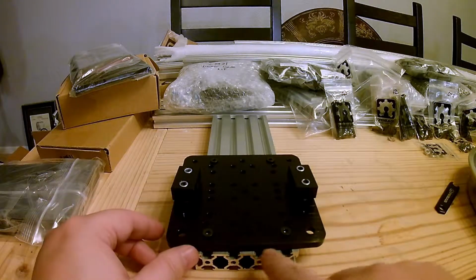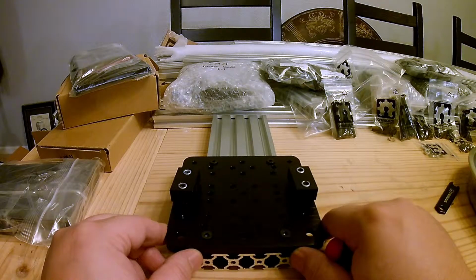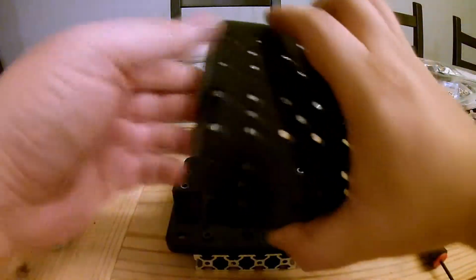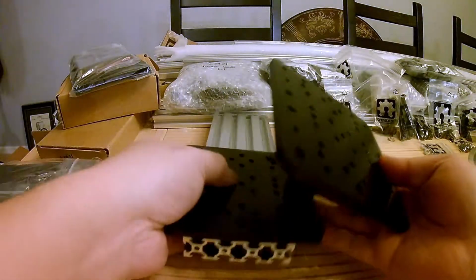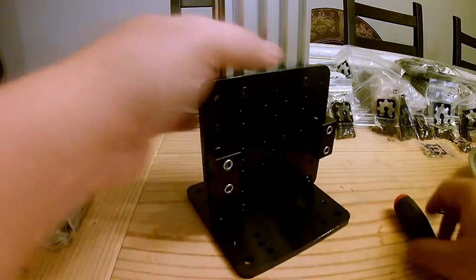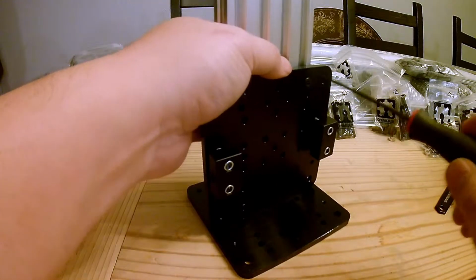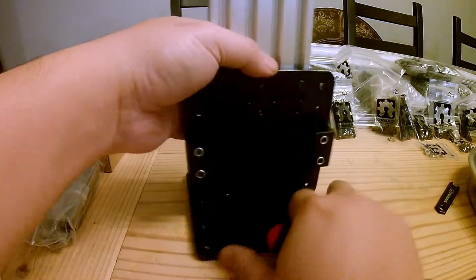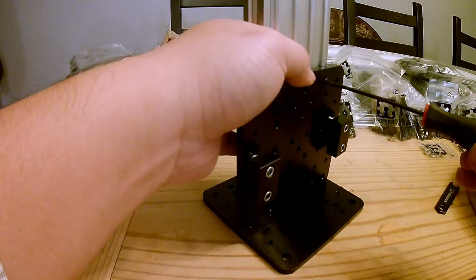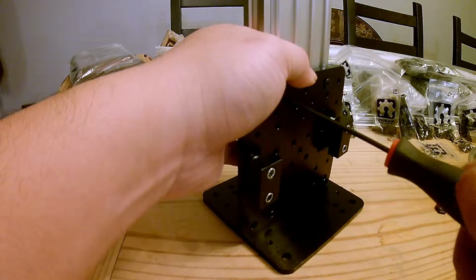Next step is to make this bottom end flush. You could probably just hold your fingertips or your thumbs flush with that edge. That would probably work. But we have a straight edge here. This is another gantry plate that came with the kit. I'm just going to set those both on top, and that should square it up. I wouldn't use my table because this thing is so warped. As you can see, this is our straight plate. This is cupped in, so as long as I'm on this plate, it should be fine. So now, with this plate lining up the bottom edge, now we can snug these down.